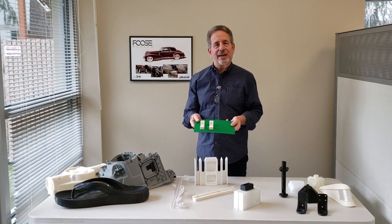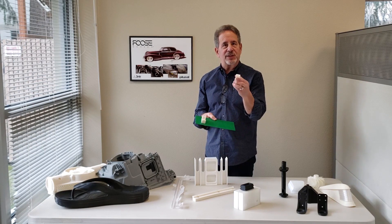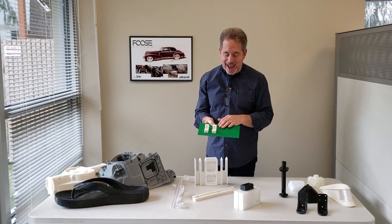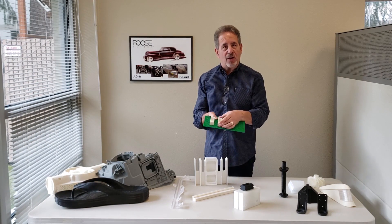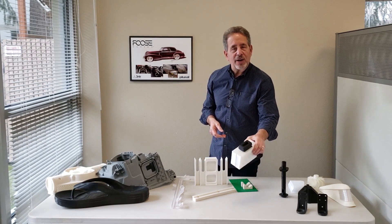This is a great example of where we used a Lego table for fixturing. These are fixtures themselves that hold a part which then has laser information put on it — laser etched. We needed a fixture for the fixtures, so we used Lego. This shows the precision and the ability to pop parts on and off the way that Lego tables work. And then we have soft jaws for secondary operations.